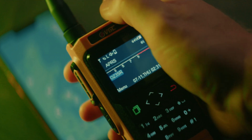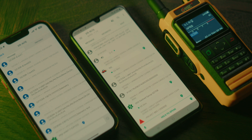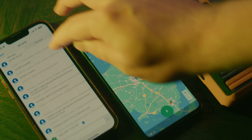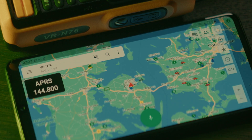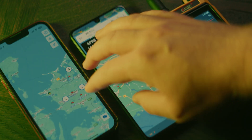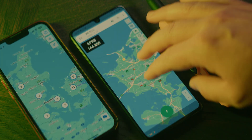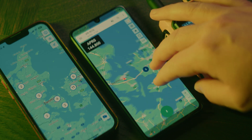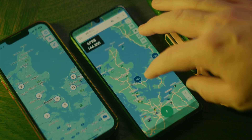Once paired, your phone stays connected and quickly reconnects when you turn the radio off and on. The smartphone app is available for both iOS and Android, although confusingly it's named just 'HT', which makes it a bit difficult to actually find on the app store. Most of the functionality is identical in the two apps, but the Android app is clearly better made and has more features. For instance, when you receive a new APRS beacon, the Android app draws a line to that station and displays the distance to it — the iOS app doesn't do this. Also, when you zoom out on the iOS app it groups stations way too early, making it difficult to get a good overview, and you cannot disable this grouping. The automatic beaconing also seems broken in the iOS app currently, though it works fine in the Android app.